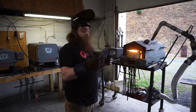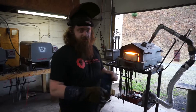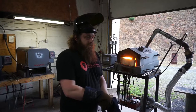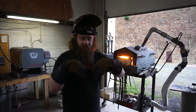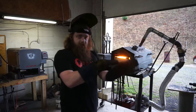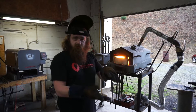The can ends are cut and the steel inside is solid. You don't want to draw it out too far before you do this cut — you just want to work that can before it stretches really long. The end looks really good. The can was peeling already, so throw it back in the heat and we'll work it still on the flat dies. Without the lid on the end, it'll help loosen things up.